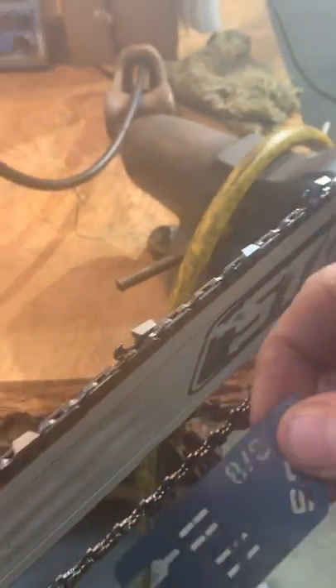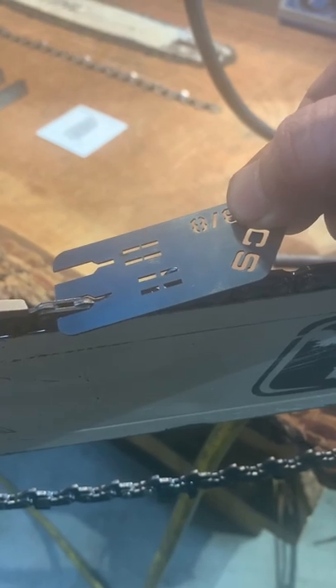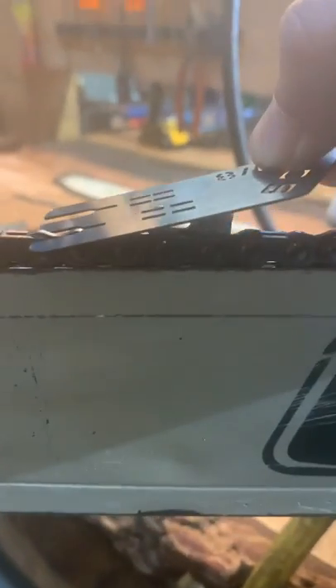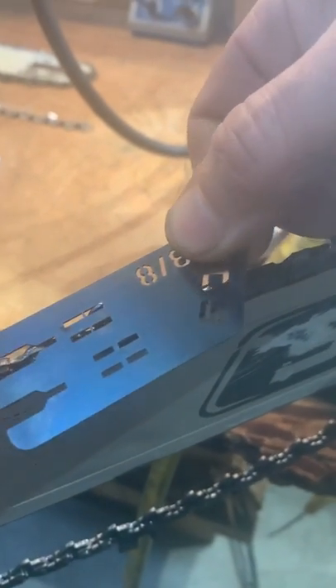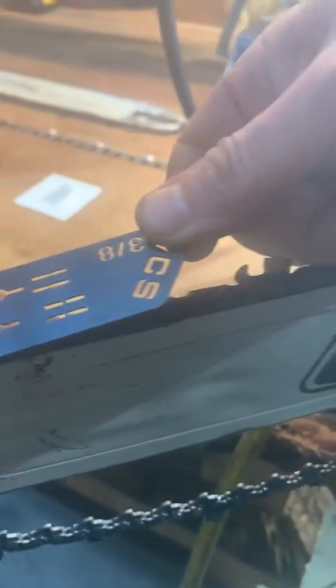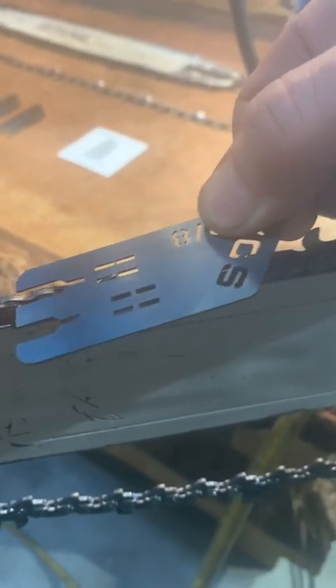I'm going to give a little instruction here on how I just manually do it. A lot of people ask me about how this thing works. Basically, that hole there is 25 thousandths, and this is a new chain. If you want to go 35, you just move it back to that one — you're just filing straight across. The next hole over here is 38 to 40 thousandths, and then that one is 50 thousandths. So once again, this is right raker and left raker — the holes are right and left raker — so that would be 25, 35, 38 to 40, and then 50 thousandths.